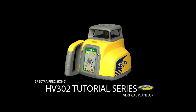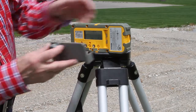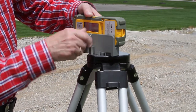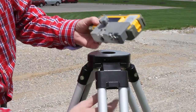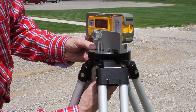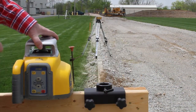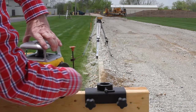How to establish a safe vertical axis in plane lock mode. Set up the tripod at the second axis point. Attach the HL vertical adapter, which also offers a 5/8 by 11 mounting thread, to the HL 760 receiver for vertical setup at the tripod. Attach the laser to the batter board adapter and mount the laser-batter board combination on the batter board.